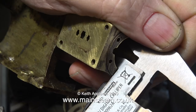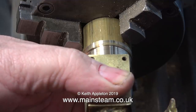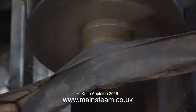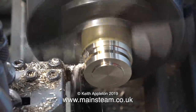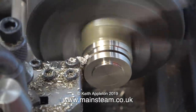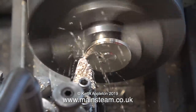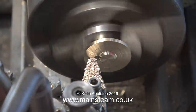I'm using my digital caliper to size the bore — it doesn't need to be switched on, I'm only sizing the cylinder bore so I can turn the piece of brass to fit. After completing the job, the register was a very good fit in the cylinder bore. I'm cleaning it up with some wet-and-dry sandpaper just to remove the sharp edges, then parting off the component. I don't need any cutting lubricant for brass because it's very soft and the tool is very sharp. The piece of brass has now been reversed and held by the register, using a round-nose carbide tip tool.